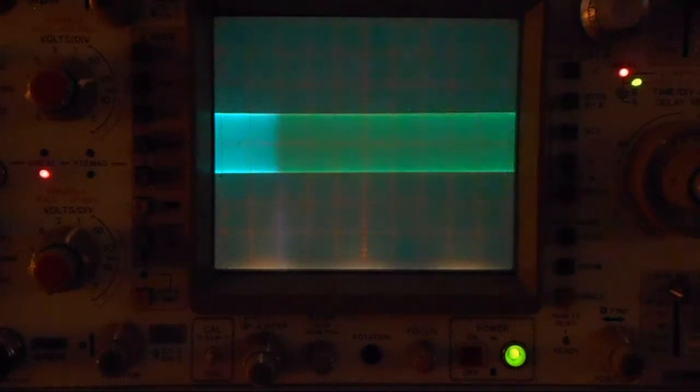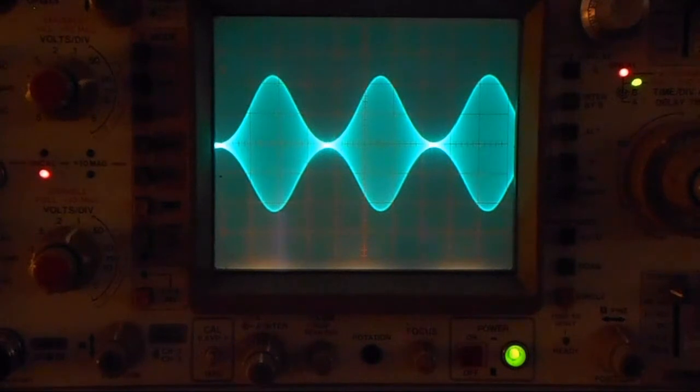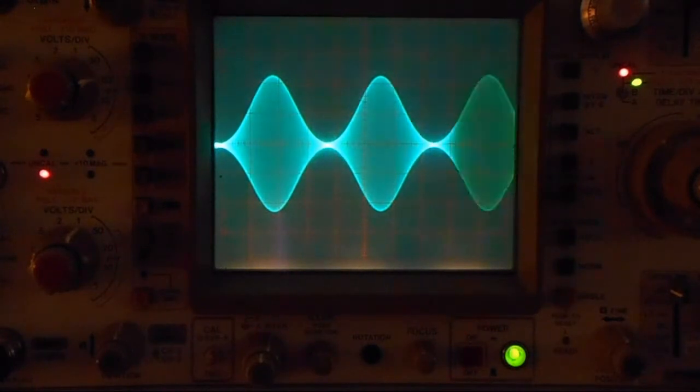Put the modulation back on. Now let's take a look at the AM carrier level, which right now is set to 100. At 100, it's impossible to drive it to the point where the waveform passes through the baseline, creating the little wavelets.